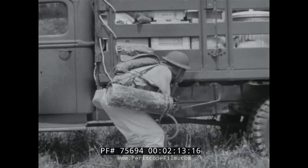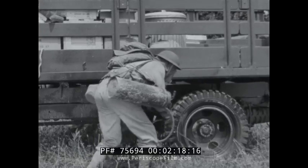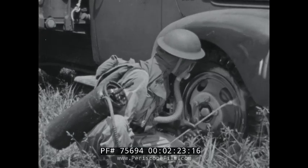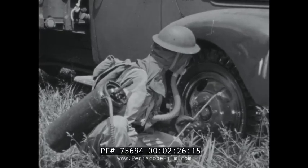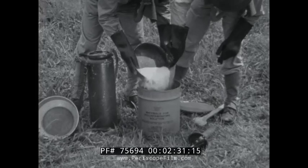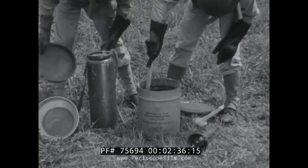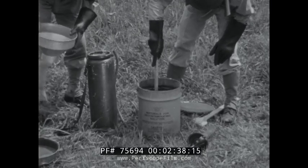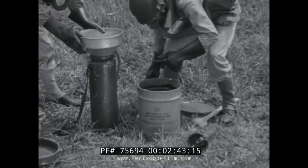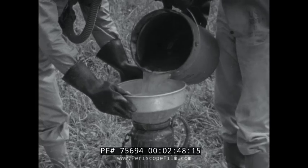The whole body of the truck is then sprayed with non-corrosive decontaminating agent. This 3-gallon apparatus is the standard equipment for second echelon work. The tank is refilled in the field by mixing the special non-corrosive white powder with acetylene tetrachloride, previously prepared in the correct measures for mixing. This is stirred until the white powder is completely dissolved, then poured into the decontaminating spray tank.